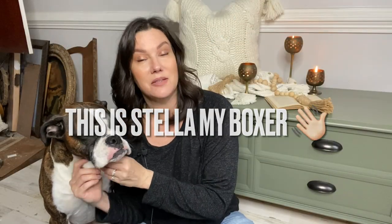So there's a couple of things that you need to know before you walk away. I want you to know that silk paint needs a cure time of approximately 30 days. You're gonna wanna make sure to baby that piece a little bit. Make sure that you're not gonna bump it around, scratch it. It needs time to cure and cure properly. Other than that, when you're done painting, you are finished.